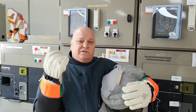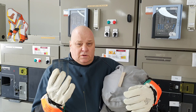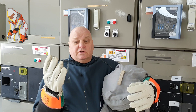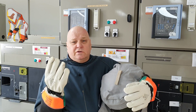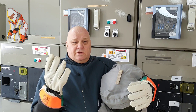The rubber gloves are not arc flash rated. The reason that about 80% of the gear that I check on sites don't have the leather gloves with them is because usually they're not included on the site procedures. If they're not included on the site procedures, then the workers tend to feel that they don't need to wear them.